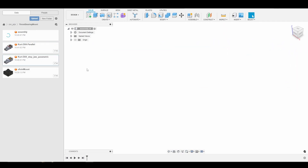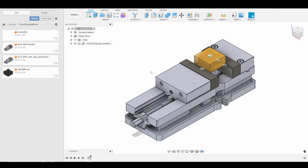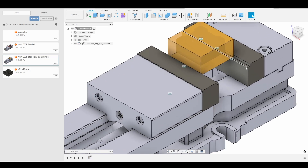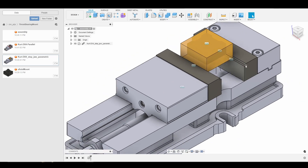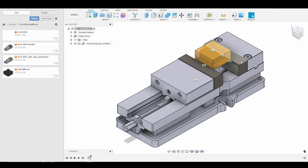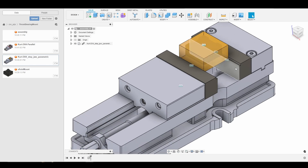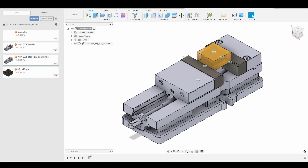I'm going to drag in the vise with parametric stock. You'll notice it says Step Jaws — that's because I'm using a pair of snap jaws that have a one-eighth inch step, which makes it easy so I don't have to use parallels, although we will be using parallels for Op 2. These are essentially quick-change jaws that make life a little easier.